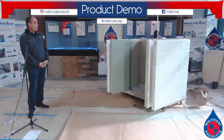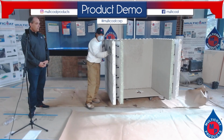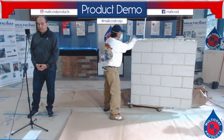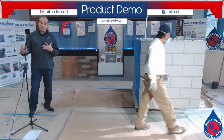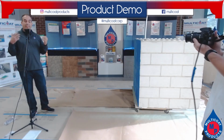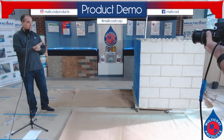So that's our BG 2000 for below grade construction. Next, we're going to show you our Slatex, which is our scratch coat and Multicoat combination. Multicoat is similar to BG, but it's a more premium product. BG is 400% elastic. Multicoat's 1,000% elastic. Multicoat's one of our oldest products. We've probably had it around all 35 years of our existence.